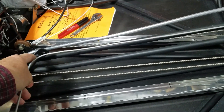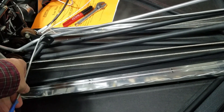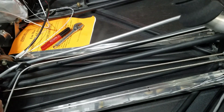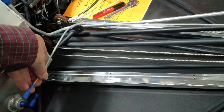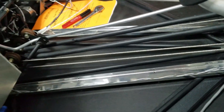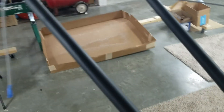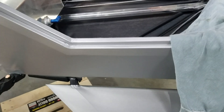I've never done much pipe bending. Eddie, I believe, was the first to talk about using a piece of wire to bend it, and then Darrow and others suggested using coat hangers. I'm glad they told me because this makes it so much easier to form fit. I just have a piece of aluminum wire — you can form fit your whole piece, bend it into the shape it needs to be, then lay your pipe on it and get your bending done. That is definitely the way to do it — it saved me a lot of headache trying to fish that pipe in and out.